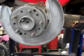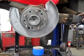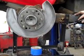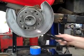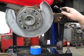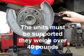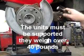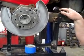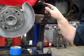The fixture we use here, it saves somebody working by themselves a lot — an extra set of hands. If you're doing this, make sure you've got it well supported with a hydraulic jack stand so it won't fall on you. These by themselves weigh about 40 pounds. You don't want to get cut by this flange or anything like that. We'll come back later after we get this trailing arm rebuilt and show you how to put it back together.